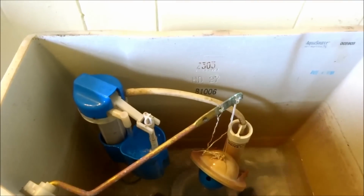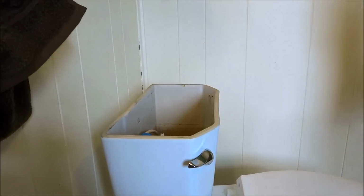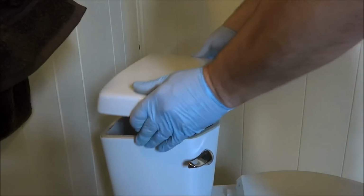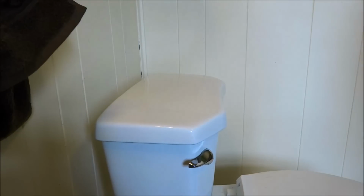Oh, you're just renting? Yeah, the landlord, he's really good, but he doesn't do much. Lately we just do it or hire somebody. Whoever he had put in the toilet, it was loose because of the big space. Well, I'll tell you, that wax wasn't even squished. I put a double wax. That's why me and my husband were gonna move the toilet. We thought a gasket or something, so I'm calling him.